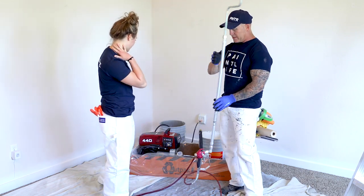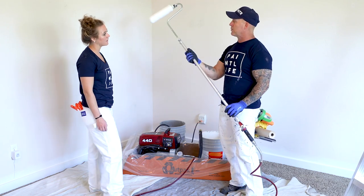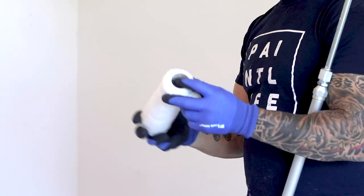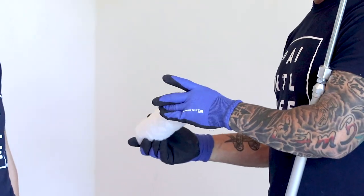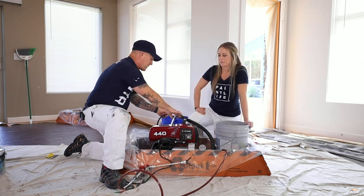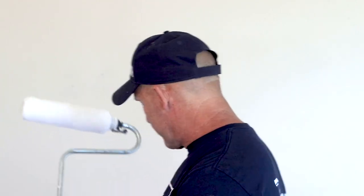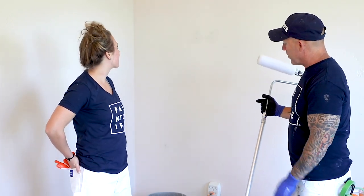This is a regular airless sprayer with an airless gun attached and an extension pole — you can add multiple extension poles for high ceilings. The roller itself has what we call a manifold inside with perforated holes where the paint comes out. It's a special roller that just snaps and slides on. You run it at really low pressure — only about 400 PSI — so a really small sprayer can use it. We're doing gray walls with pure white trim and pure white ceilings, which is going to look really modern and cool.